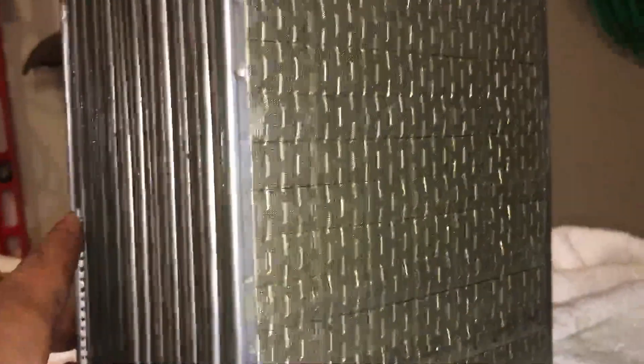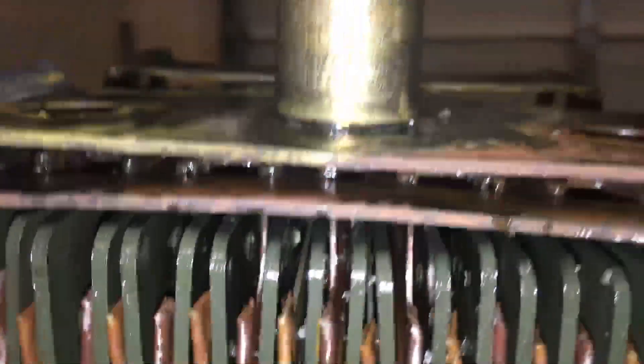This is what the cell looks like. This is the positive plate right here, and the negative plate looks pretty much the same, but you can see it's a different color — that's the iron, and this is the nickel. Comparing the Edison-style cells to these, I have to say the Edison cells are far better quality. With these cells, there are no bolts to take apart — you can't disassemble them. There are plastic dividers in there that keep the cells apart, which I think is a good approach. They're thick enough, and you can see the cell is welded together and separated by plastic.